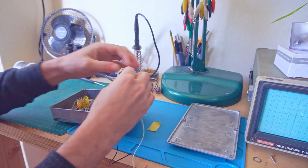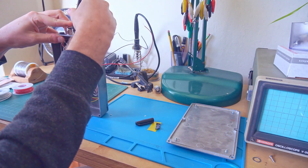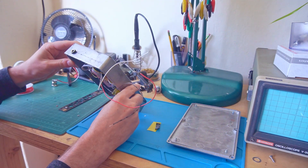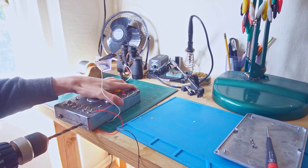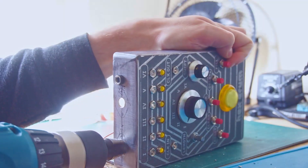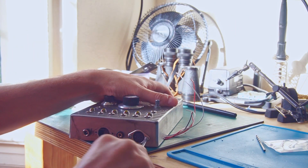I began by figuring out the placement of the MIDI in and output jacks, which was not an easy task on this enclosure, as I had already packed the connections very tightly. Ultimately, I found just enough space on the back of the case if I put them really low on the outer flange. I drilled some holes for these jacks with a twist drill bit and a big conical step drill bit, which is really handy for drilling larger diameter holes. These just get self-tapping screws into the aluminum, which holds the jacks in really tightly.